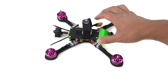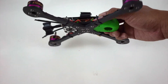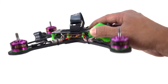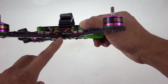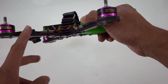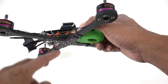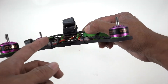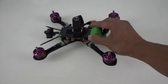Another goal I had in mind when designing this frame was to isolate the flight controller from vibration. This is one of the reasons why I don't particularly like flying unibodies. Unibody frames — vibration from the motor transfers all the way down the arm, directly into the plate, and your flight controller is tied to that plate. I wanted to create a structure that protects the flight controller from vibrations, and that's the reason why this frame has a sandwich architecture. Any vibration that comes from the motor and the prop may transfer through the arm, but having a 5mm arm helps prevent that. When it reaches the main body, where you have 1.5mm plates on the top and bottom, that vibration tends to stop there since the resonant frequency of the center of the body is so much higher. That combined with these TPU air mounts that I've designed — they allow the flight controller to float freely and really protect it from seeing vibrations that originate from your propellers and motors.